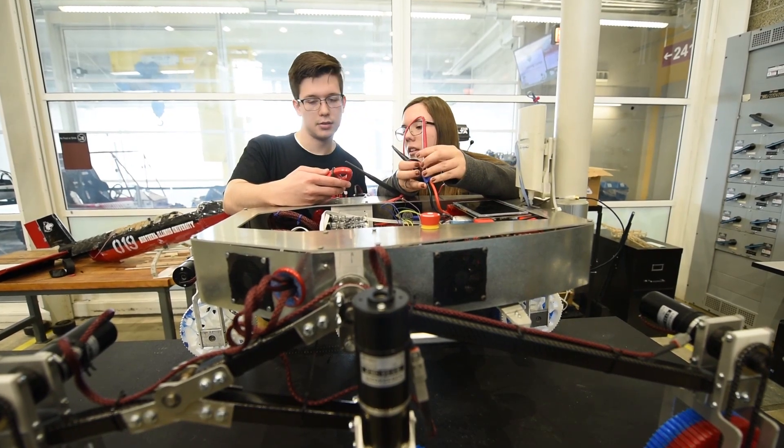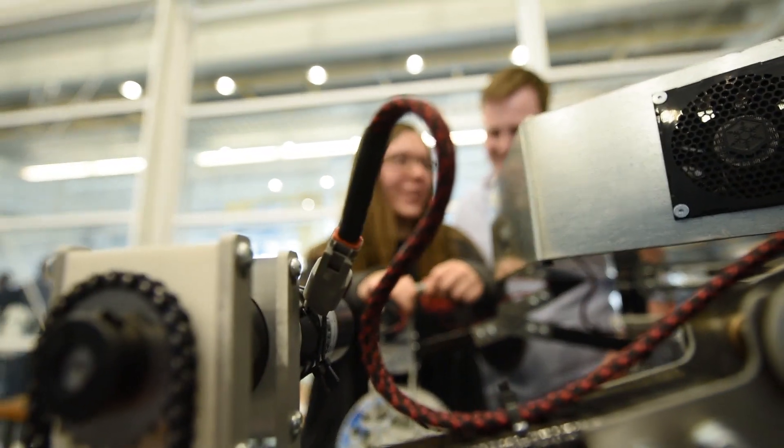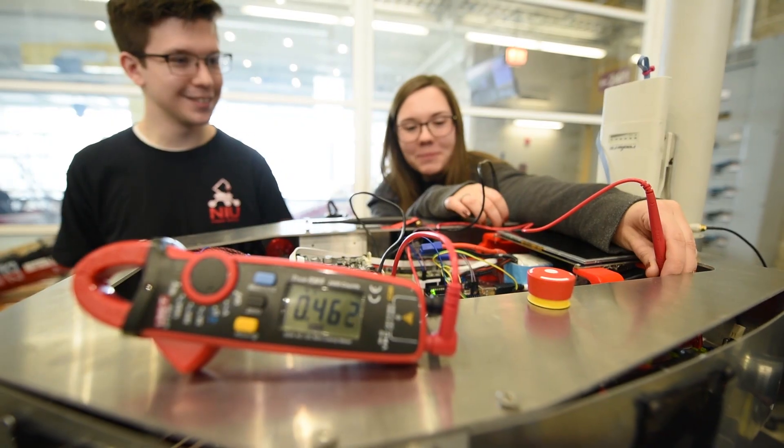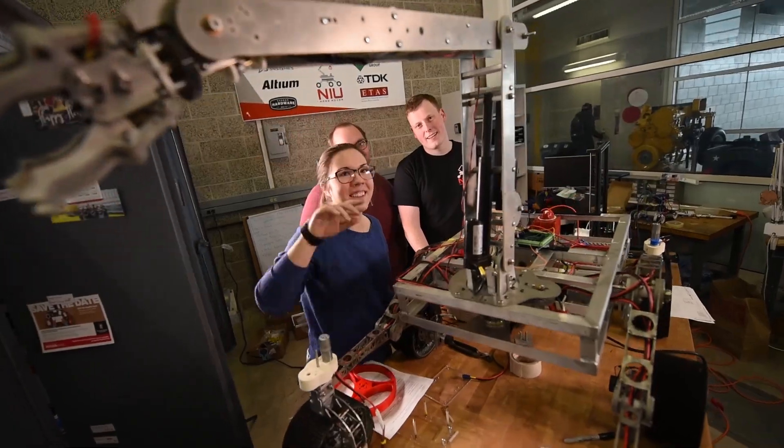In order to be able to access the capabilities of the rover while the PDCB was in development, a test bench composed of a BEX, an Arduino Mega, a TX2, and three 24-volt LiPo batteries were utilized. We're using six Talon SRX ESCs for drive motor control. These utilize PWM signals in order to communicate with the power distribution and control board.